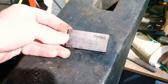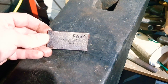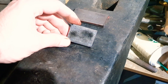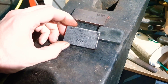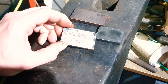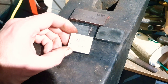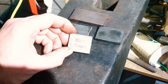The results are in and they're kind of surprising. Here is how the paint turned out: a little bit blotchy, came out okay especially on the small part, but the downside is having to leave the paint 24 hours to dry fully — so it's a time consuming process for that kind of result. The pen, as you can see, you can kind of make out that it worked a little bit, but this is a no-go — the actual pen didn't hold up. The packing tape worked okay — it's a very fine result and the trick would be etching for longer. The electrical tape came out very blotchy, probably not quite as good as the packing tape, so I'd rather stick with packing tape.